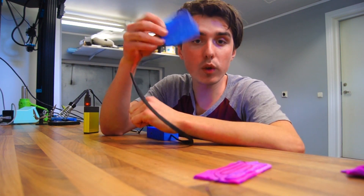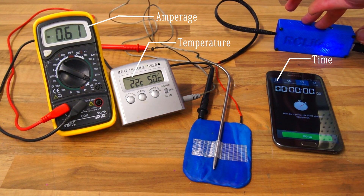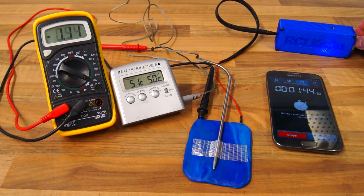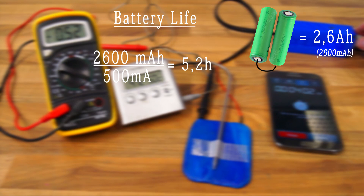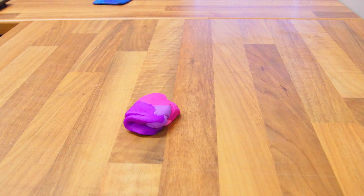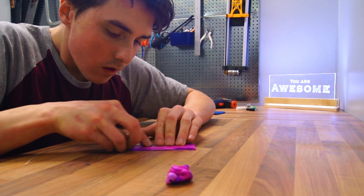I'm curious to see for how long we can power this thing. It's safe to say it would have a true battery life of two, maybe even up to three hours. I then continued to experiment with different shapes and lengths of kanthal wire to find the most efficient one, and in the end the rectangular shape with 30 centimeters of kanthal wire performed the best.